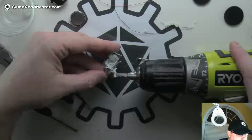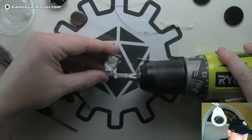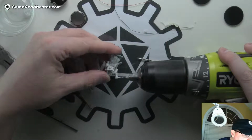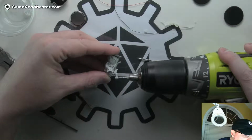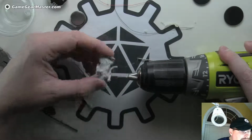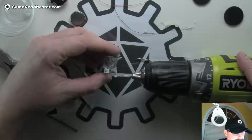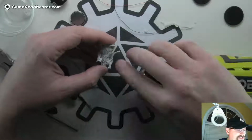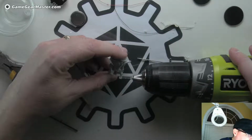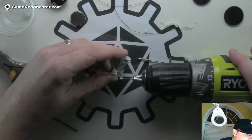Okay, that's looking pretty good. So I'm going to start slow. Keep an eye on it. After a while, you probably want to pull the mini out from the drill bit, because this melts the plastic in the mini as much as it actually cuts it. So what'll happen is you'll get these long tendrils that smear all over the drill bit, and you may have to clear them out. Otherwise, you just won't do anything other than heat up the mini and possibly melt the hand. Go back in there.